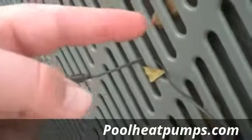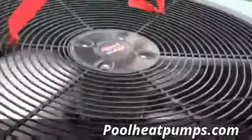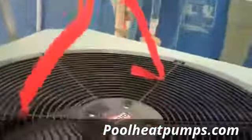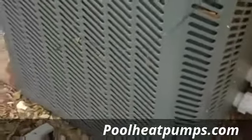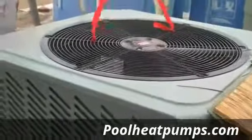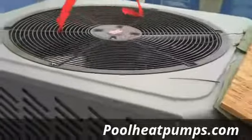This sensor is measuring the air temperature being drawn into the evaporator coil, where the heat is taken out of it, and what's left over is cold air shooting out of the top — as you can see by the ribbons I have tied on here. I also have an external thermometer showing 28% humidity with about 62-degree air. Very dry conditions. There are a lot of misconceptions about these heat pumps working in the desert southwest and western United States — that they don't work well in dry climates. That's actually a very big misconception.